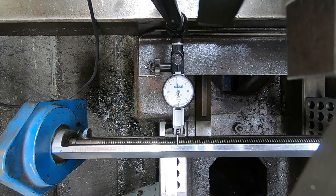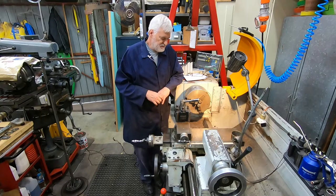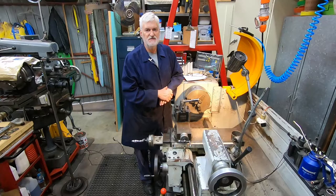What counts here is knowing that to get a valid centring position, I've got to be aware that the back of the carriage is 0.3 millimeters lower than the front. Given how much wear there is in this lathe, it's starting to look really quite doubtful whether a height setting post to sit on the lathe bed is actually going to be useful to me — but I'll give it a go anyway. The key thing to determine is the difference in centre height measured on the centreline of the lathe — where the pip in the middle of a facing operation will turn up — versus the centre height measured out where the tool post is.